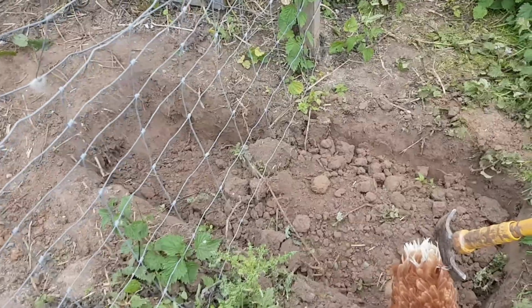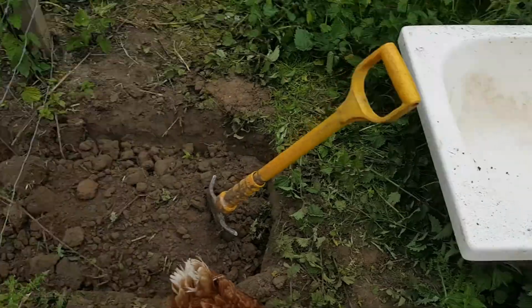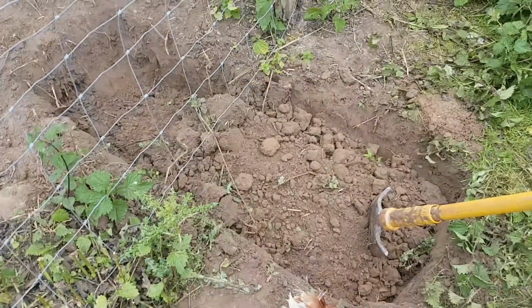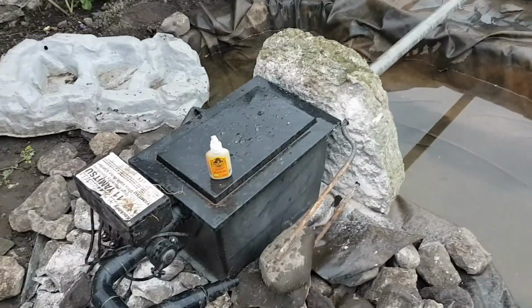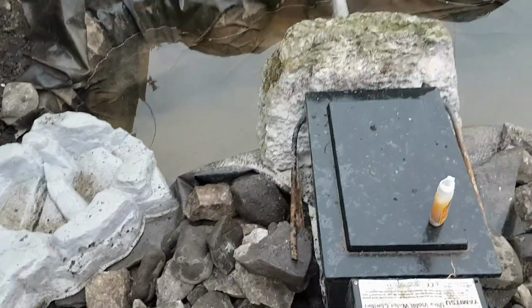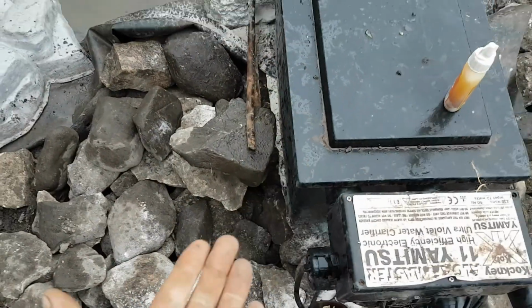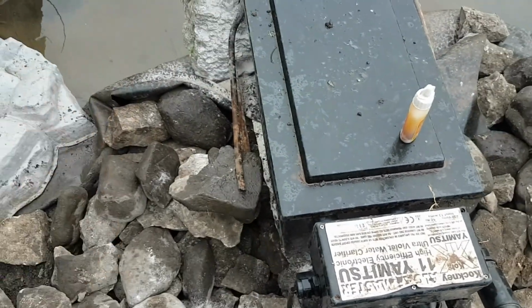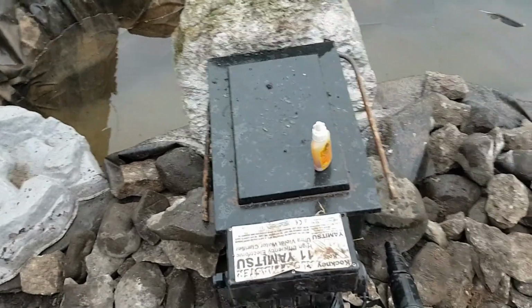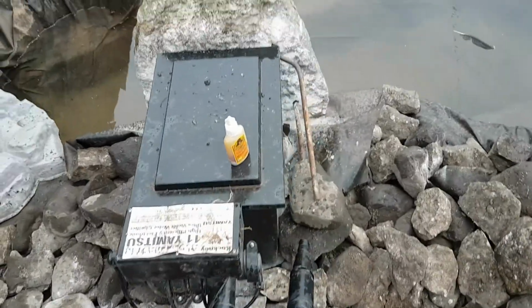Oh, got so far along, just got called away on other business, but we're getting there. Don't realise how big a bath is until you try and dig a hole for it. So just setting these bits of bar in, you can see, to set the frame, and then I'll build a box inside there, and then there'll be concrete all the way up, and then just fascia it with stone and slate, and then either sandstone or slate top. But once again, we don't want to do too much of that planning, that confuses things.